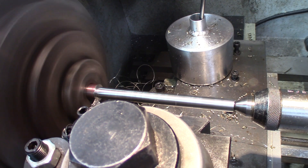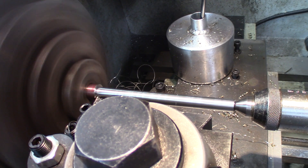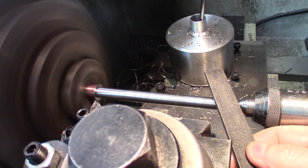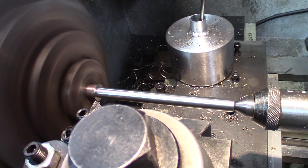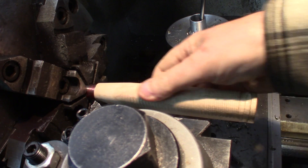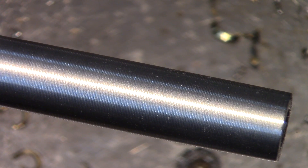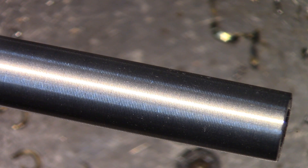Going to code length, just make that shoulder cut. That's it — light sanding, light deburring at the end. Perfect. One done. Let's see if it fits now — cleaning up and testing with the test handle. Nice fit, perfect. This gives you a pretty extreme close-up of the part. You can see the thread-like finish on this — it's the result of a ten thousandth of an inch advance, and it's something I want on this to help with better adhesion for gluing.